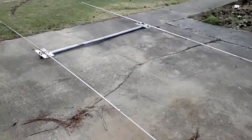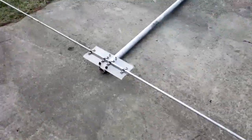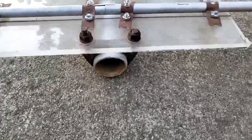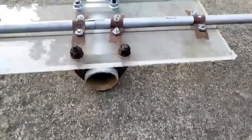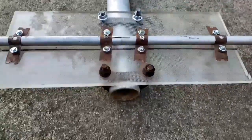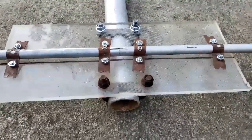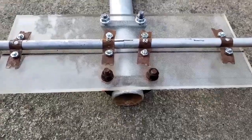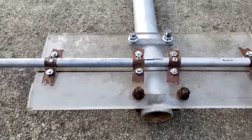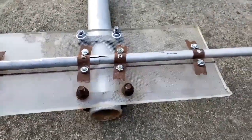We're doing a homemade direct feed two-element Yagi. What I did was I used plexiglass that's three-eighths of an inch thick, drilled all my holes for my U-bolts, and made up some rusty clamps. That doesn't matter because this is just the reflector, so it doesn't really matter what's holding them down. I'll put some spray paint on that later, but for now it's good enough.